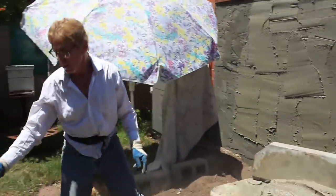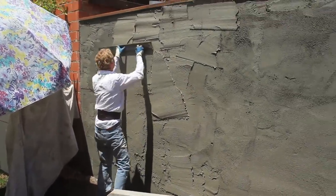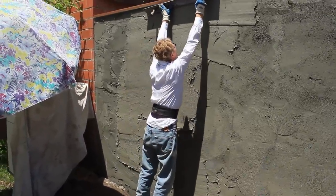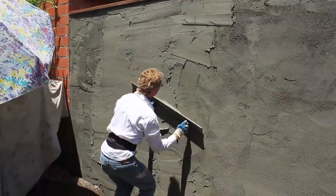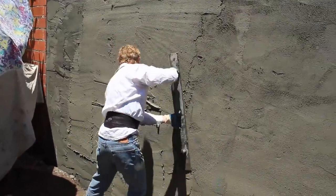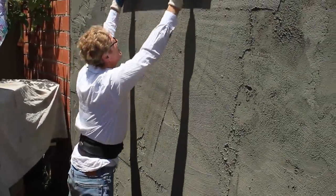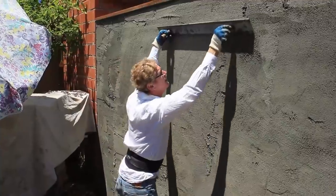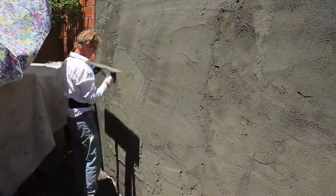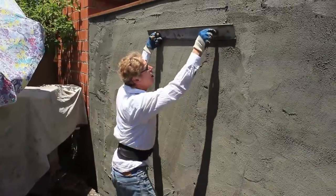Darby time - always wet the darby. We're going to take this mud and move it around. Stretching up on my tiptoes to reach the top, straighten the middle section out. That gives you a pretty full wall and by the time this sets you've got a lot of strength going on. It would happen to be about 100 degrees today, so we wet the walls prior. What you guys aren't seeing is me misting these walls over and over because I don't want it to set too fast.